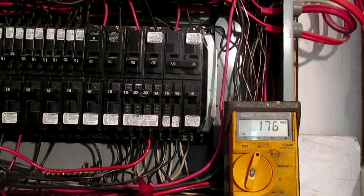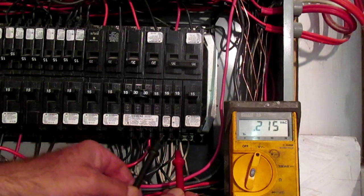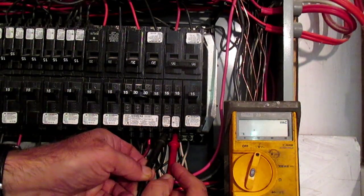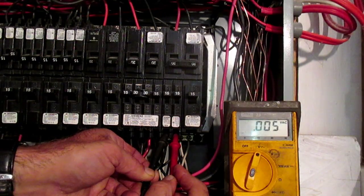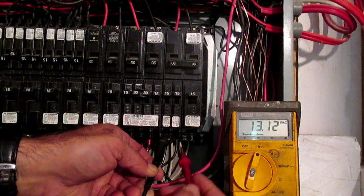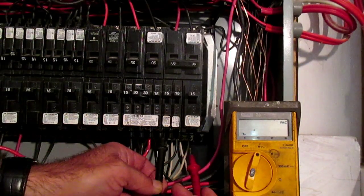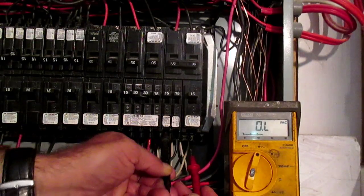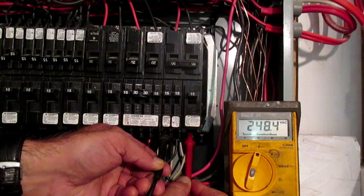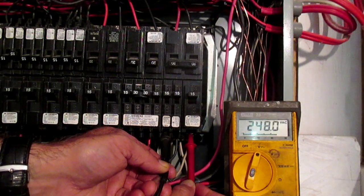I just want to illustrate again how these breakers work. This is a breaker slot with two breakers in it. If I go between the connectors in the bottom, even though we can wire up two electrical circuits — watch the meter over there — you'll see that there's no voltage difference between them. That's because although they're providing electricity for two different circuits, it's not the plus and minus 120 that we require for our range. Now I'm going to leave my electrical probe on here and go over to the next slot over, and we should see our 240 volts because we're going between two slots. So between where my probes are is the 240 volts that we require for the electric stove.